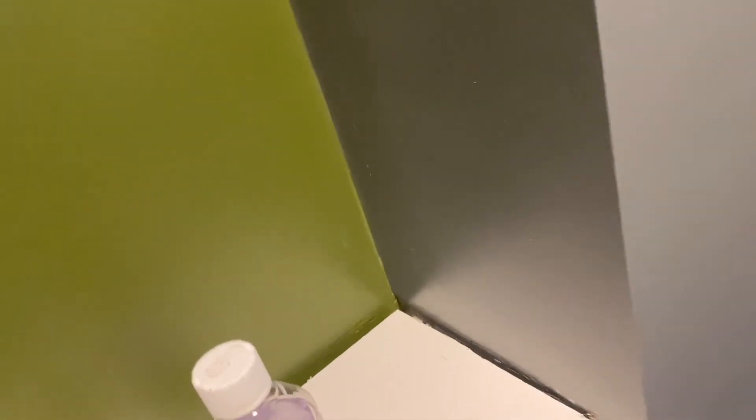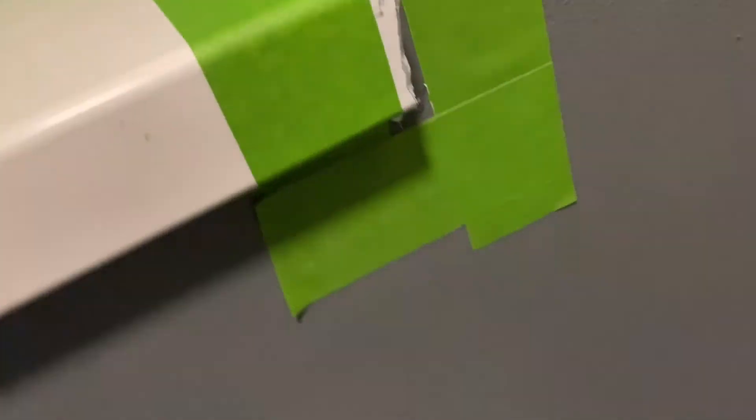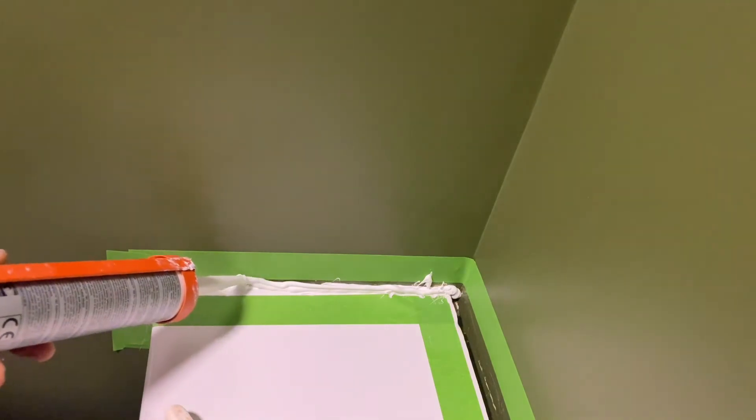To save time, I did some masking on the white plastic and painted the area where the previous sealant sat. You can see right at the bottom of the green-painted wall it's all painted green there. The next step, as before, would be to tape the gap between the wall and the plastic — pretty much where I would want to fill in the new silicone sealant. I used the old chunk of sealant that was removed to work out the profiling tool needed to spread the sealant, as well as the amount of sealant that would be required.